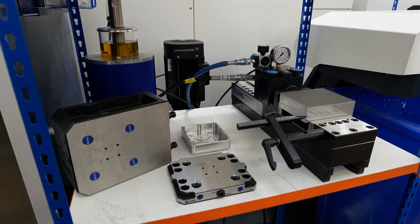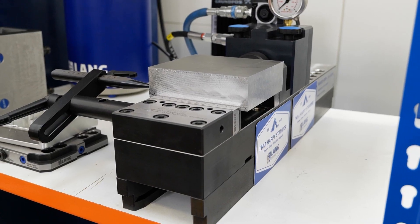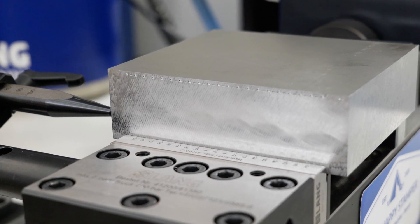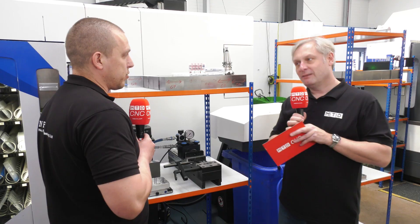We have it because we need more safe work-holding. On the base is a pre-stamping unit, so we stamp the material — we make sure that we do not introduce any more stress to the material when we're using holding devices. That's why we start with a pre-stamping unit, and then we have multiple different options from LANG to hold the parts.